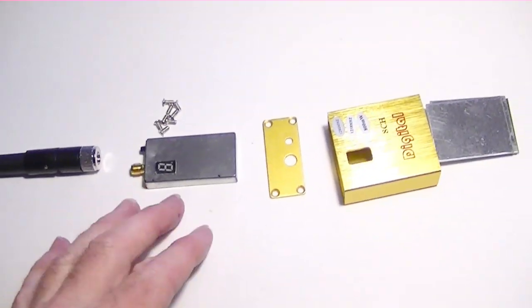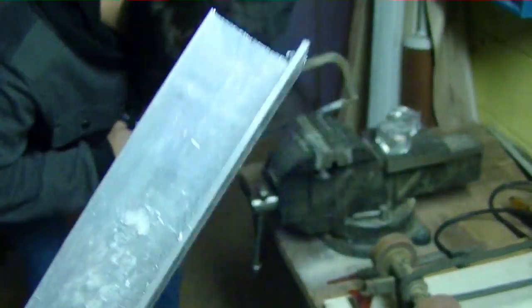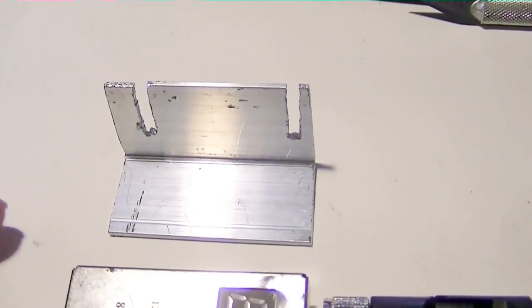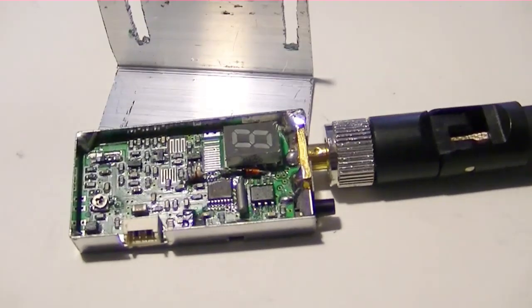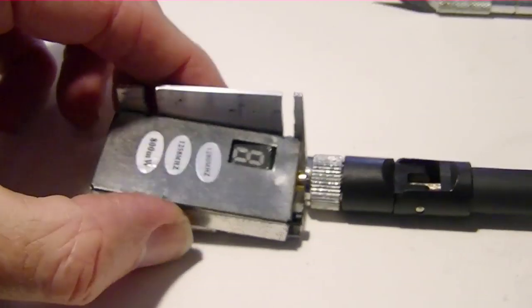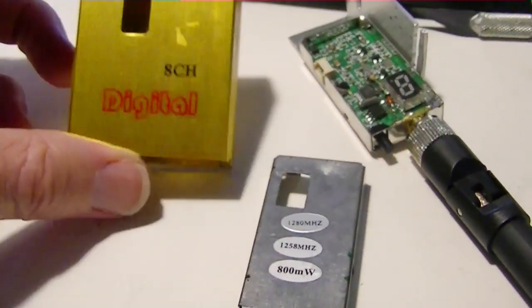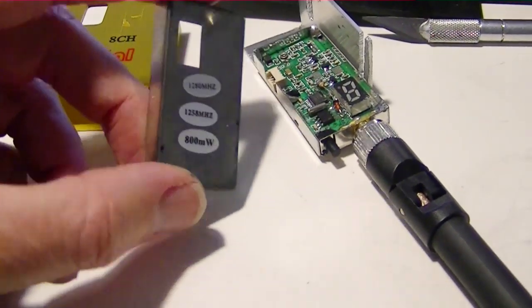What I'm doing is taking all that away and making our own heat sink, as recommended by the viewers. So here is John cutting two pieces of scrap aluminum to make a heat sink underneath. Here's one of the aluminum pieces John just made and the radio — the cover just came off, but anyway the radio is going to sit right there with another bracket on the other side, giving me a fin on both sides. I've also transferred the labels off the original case onto this one so I still maintain my frequency and milliwatt tags.